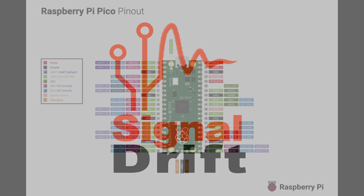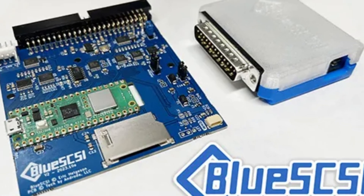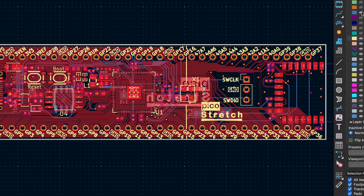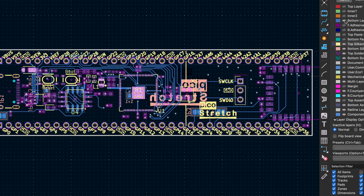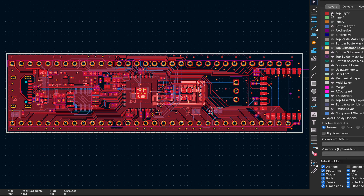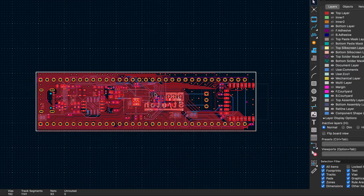I love Raspberry Pi Pico microcontrollers, but I wanted more GPIO options, more memory, and wireless, without losing compatibility with the massive ecosystem of Pi Pico add-ons. I used the Raspberry Pi RP2350 reference designs and an open-source design from JLCPCB to guide my work, and took some inspiration from a similar Pimoroni dev board. The tricky bit: the RP2350B wants a neat peripheral pin order, so breaking the GPIOs out into classic versus extended segments meant creative routing.